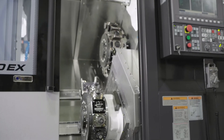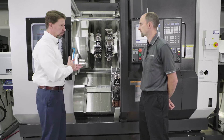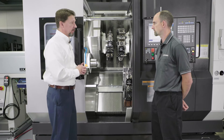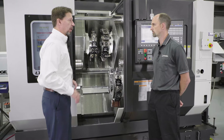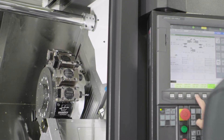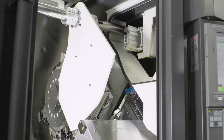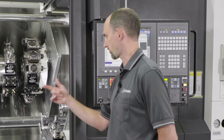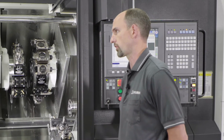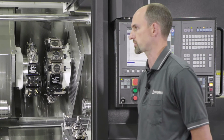This machine, as you can tell, has a lot going on in a small amount of real estate — it's really meant for high-volume production. We have the available part unloader. The part unloader is fully programmable so you can use it to unload a finished part while you're still working on the opposite spindle. It's also able to reach onto both spindles, giving you greater process flexibility whether you machine left to right or right to left. You can also use it to unload your bar remnants, which keeps you from dropping bar remnants on the way covers and causing damage to the machine.